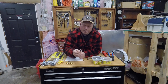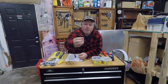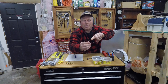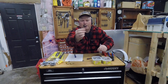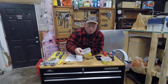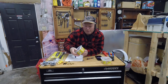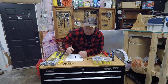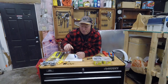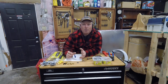The other thing you're going to need are these J-hooks. They have a nail and what that does is it fits into the PEX tube and you nail it in place to support it. And then of course you need your pinch clamps. So there are a couple of different kinds of PEX tools — this kind with the pinch clamps and then there's the other one.